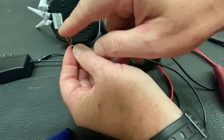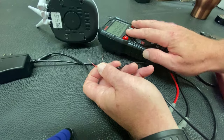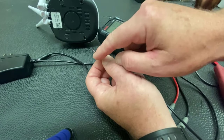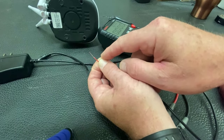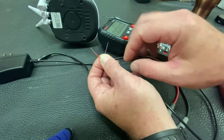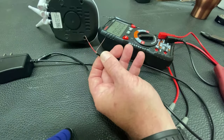Now this is fully exposed and you have about an inch of the center conductor. If you have the equipment, I'd definitely recommend using a multimeter and measuring the DC from this connector to this one. This is going to be your positive conductor; this could be a negative conductor. You basically want to see something between 4.9 and 6 volts, since this is a 5-volt transformer — they're typically not exactly dead on 5, but you want to be within a 10 percent tolerance, which is typical in DC electronics.